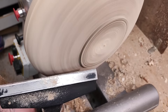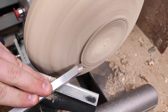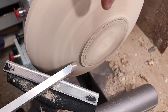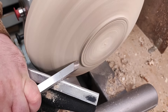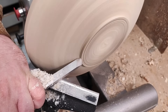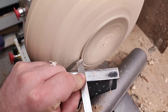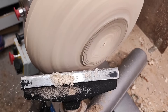The wrong way of cutting this with the skew is going the other direction. You can do it, but you have to negotiate the skew that way — and also you're facing the end grain, which is really much tougher. This is a partially dried blank, and you can see you're making dust instead of shavings. Going into side grain is much more easy and comfortable — you're just scraping the side grain. And that's a nice, clean tenon.